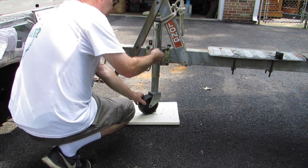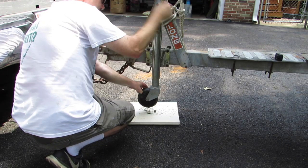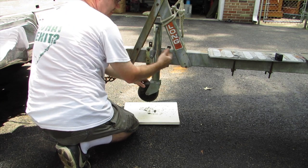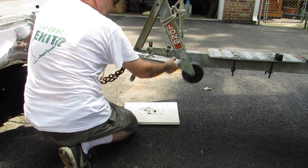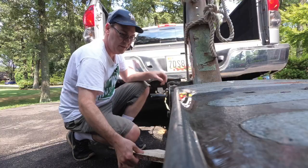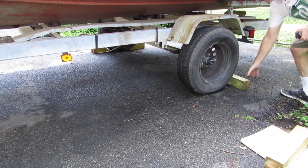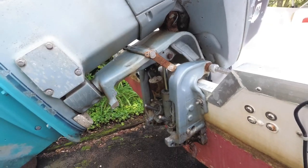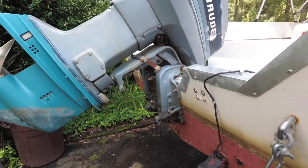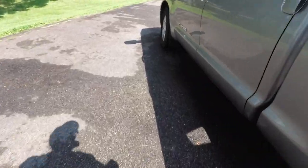So now we raise up our wheel. This also has a mechanism to tilt, so I can rotate my wheel all the way up. Take out my board. Next, we remove our wheel chocks. Make sure our engine is latched in the upright position — you don't want your engine flopping down. Get our other wheel chocks from the other side. Then we test our lights.